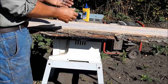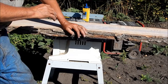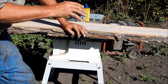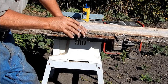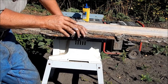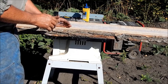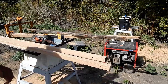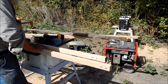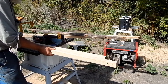If you ever look at old horse gear like the draw bars, single trees, and double trees — when they made them they split that wood out before they cut it. They made sure the grain ran the right way because it's very important, especially in things like a handle. Now I have two good solid oak straight-grain pieces.